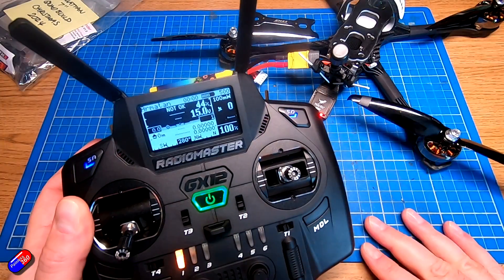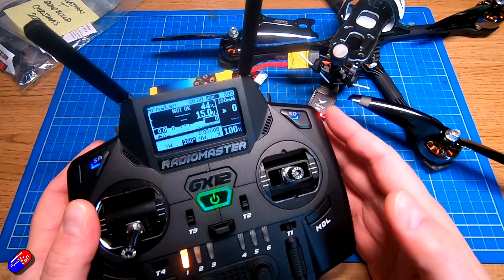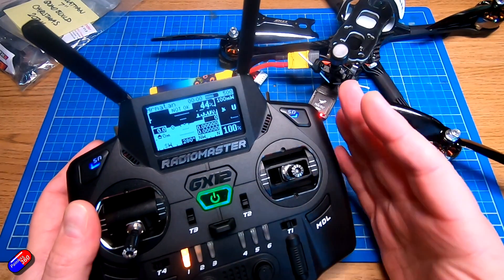It's incredibly handy to have the iNav Lua script running on your radio and getting the telemetry sent back from your quad, because the radio will do announcements — let you know things like battery levels remaining, flight modes, and when your GPS has a lock. All of that goodness is automatically spoken out to you. When you plug the model in, it'll take a minute or two to get a GPS lock, and while you're chatting to your flying buddies, your radio will announce when it's ready to go.